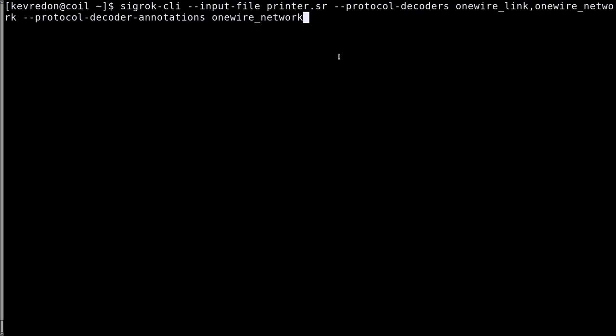So I will use this program to list them: sigrok-cli. I've presented PulseView, and PulseView is quite a nice tool to have the visual representation of the trace. You can see the trace going up and down, you can see the timing, you can browse around quite easily. So as a graphical interface, it's perfect. But what we want now is really the data which we saw in a machine parsable way. For that, sigrok-cli is quite useful. They both use the same library, libsigrokdecode, which has a list of sigrok decoders for all different protocols